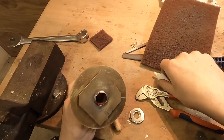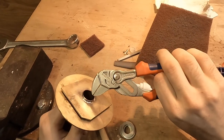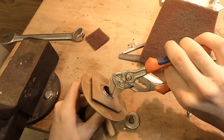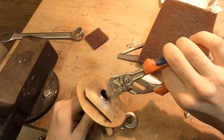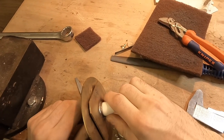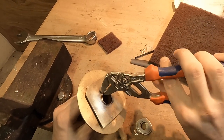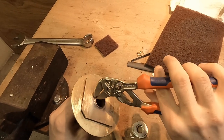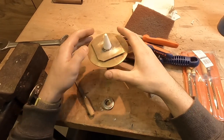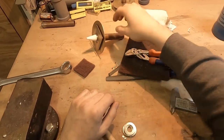Make sure you don't bend it in too much so you don't mess up the soldering joint. That is much better now. Just a slight bit more — just a slight amount. Now we have a snug fit and the feed is mechanically finished. We will measure it and then see how it performs.